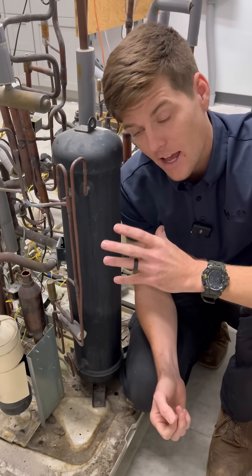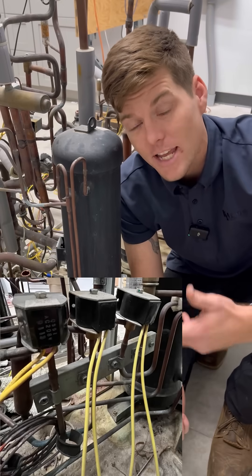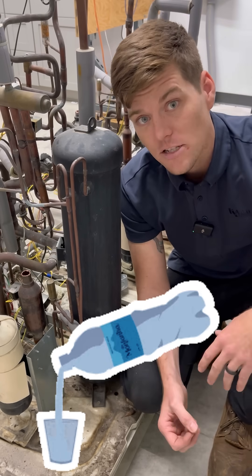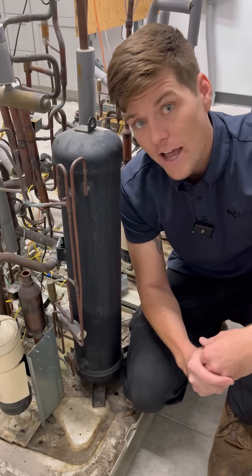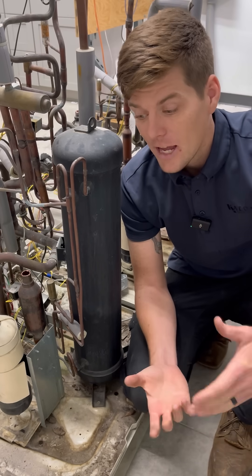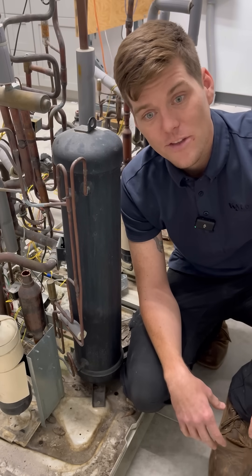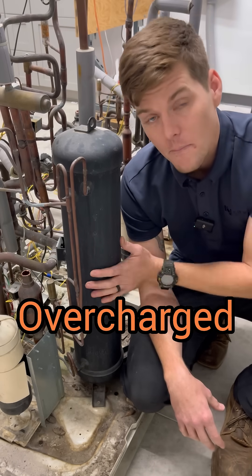The problem with this — and not many people come across it in the field — is when these solenoid valves fail or there's contamination on some of these capillary tubes, there are certain scenarios where this will actually stack liquid refrigerant and not charge it back into the system. It's those calls where the system is low on charge, you leak check it, you don't find a leak, you add charge back, and it's low on charge again. You go back a third time, leak check it, add charge, and now it stops having a problem. But then come shoulder season or any other season throughout the year, you find that it's randomly becoming overcharged. Something you want to investigate — look into VRV3 — but that's what it is.